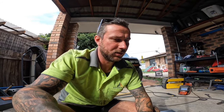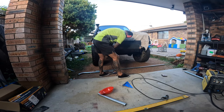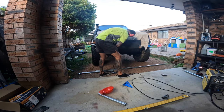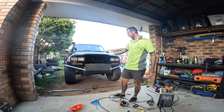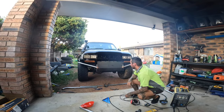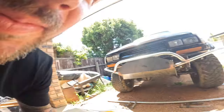I also grabbed my tube today — got quite a bit of it because I'll use some for my rock sliders as well. We'll start cutting this and getting it to the right width, then weld our end cap on. We just cut 45mm off just to bring the tube down slightly — looks heaps better like that.